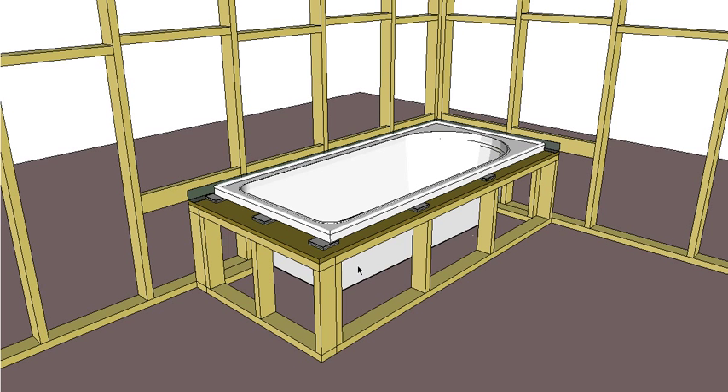However nowadays some people have taken to using low-expanding foam. I would suggest that if you're going to use expanding foam, you need to weigh the bath down when you put it in because it may actually lift the bath out of position. Fill the bath up with water, or at least half up, so that the foam doesn't push the bath out of place. So that's one method of placing the bath.